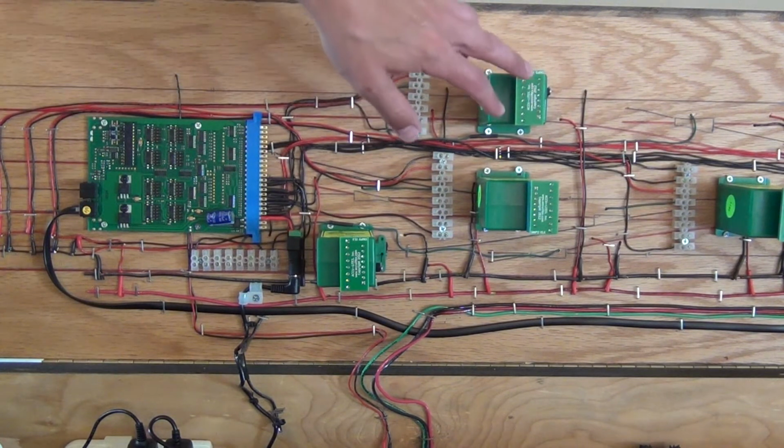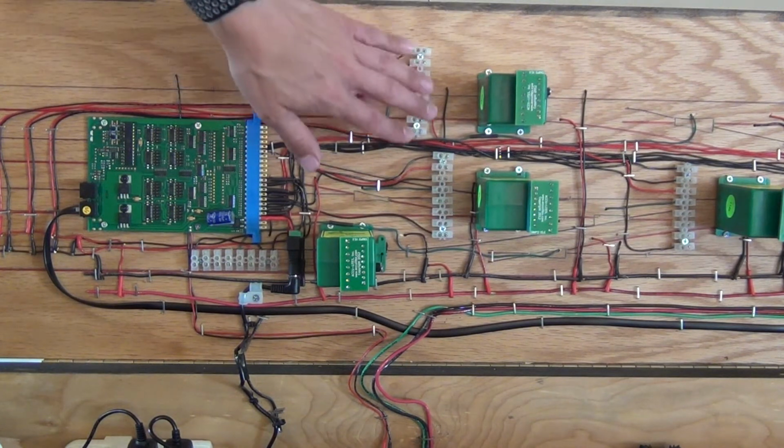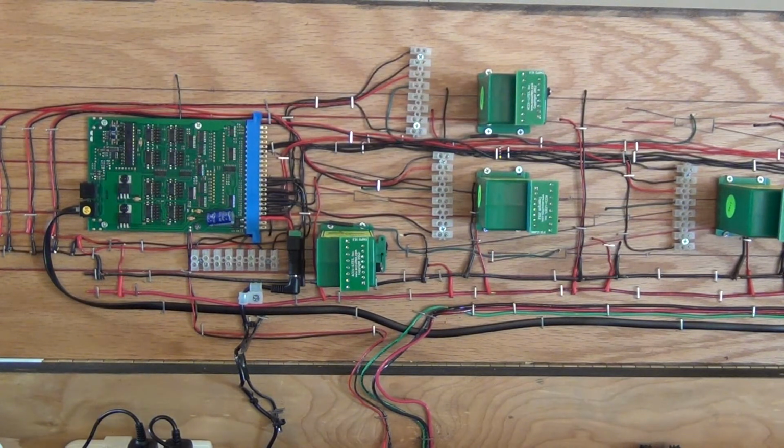But since I'm going to go ahead and wire these up, I'm going to pre-wire those last 3 wires. So there's going to be 8 wires going into the Tortoise, even though we'll get to the other 3 once I get these wired up. So I'm going to go ahead and get one of these edge connectors wired up, and I'll show you how that works.